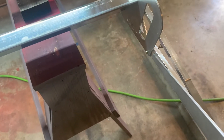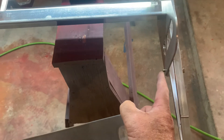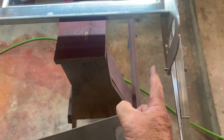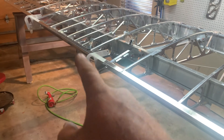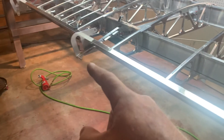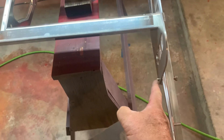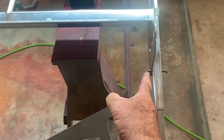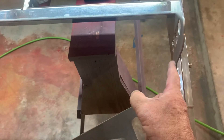They say if you've got the aileron here, put two washers — two 416 washers. What happens is your aileron is going to come down to here, and instead of being the perfect 51 and an eighth, they were saying add two washers because when we install the aileron out here we're going to install it up here and put a bolt through here, but we're going to put two washers in here just to give a little bit of spacing. These are already designed to have washers, so you'll see when you go to install the ailerons and the flaps, the bolts go through and they'll have washers either side, and you can adjust them a little bit. In any case, we're going to have 51 and an eighth plus two 416 washers. Just measure two of those washers — this is where we're going to end up setting this at.